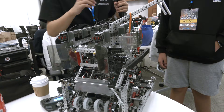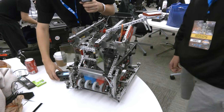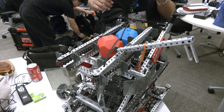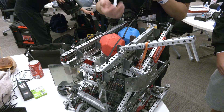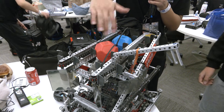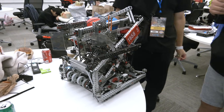Once we want to score, it can spin really fast and has great push power, which allows us to push balls directly into the middle control zone in autonomous and also sometimes push blocks into the opponent's robot. Let me pass the microphone — can we see a couple blocks come in and demonstrate how it works? And I noticed these zip ties you have on top of the robot — is that meant to keep the blocks inside? I added the zip ties because the balls would fly off sometimes, and this makes sure the ball doesn't fly off that way, because if it goes that direction it's going to jam. And it's been successful so far.